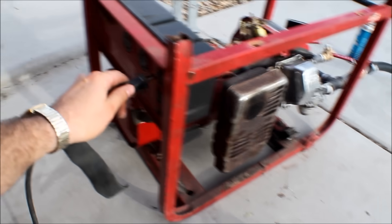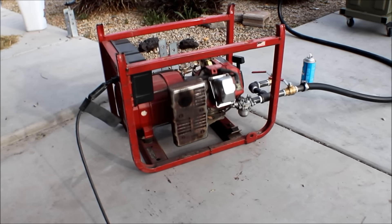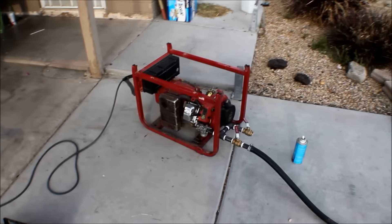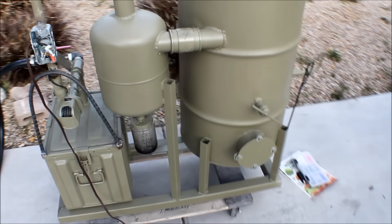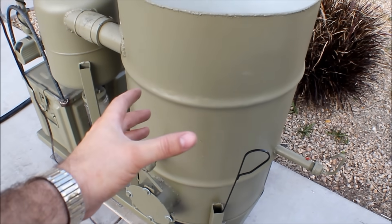If I'm good enough I can plug in my saw — let's see if I can. So there you go. I'm running my generator completely on the vapors produced by this gasifier. I'll put up some pictures of what the inside looks like — the basket, the shaker assembly, and the fire tube going down into it. You can already see it's used up a little bit of these pellets and you can start to see the fire tube there.